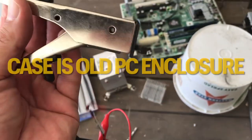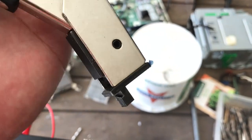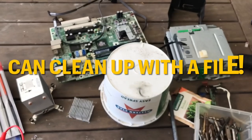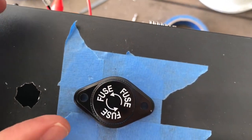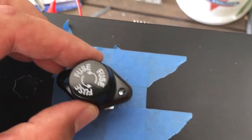The tool I'm using is called a nibbling tool - you slide the head through the hole and, as the name implies, it nibbles away small chunks of metal. Provided you don't nibble away too much, you'll get away with it. And that's us in - we just need to drill the holes to hold it in position.